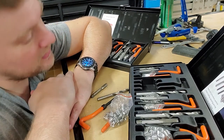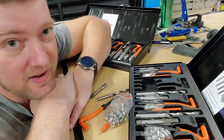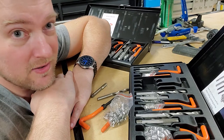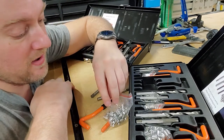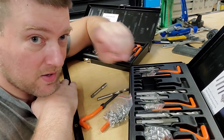This has its pluses and minuses. If you're going into aluminum, these are going to be excellent because helicoils are harder than aluminum, and aluminum sees a lot of wear and tear. If you have clamps or parts that are aluminum and are getting wallered out or experiencing galling, drill it out and put a helicoil in — the harder stainless steel will give you a much better threaded opening.